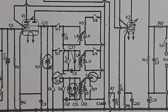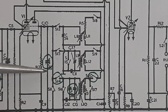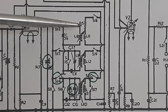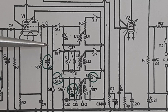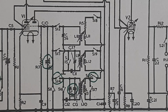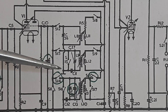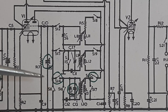I got an oscilloscope and scoped at the tuning condenser for the oscillator stage. While I had short wave one, two, and three selected, there was a proper waveform showing the different frequencies of the oscillator working. However, when I selected medium and long wave, it just went dead — nothing at all. I tried to focus around that area, but it was difficult to get at because this radio was manufactured in layers and I don't think they were ever meant to be repaired at this stage.